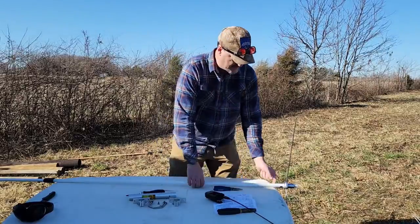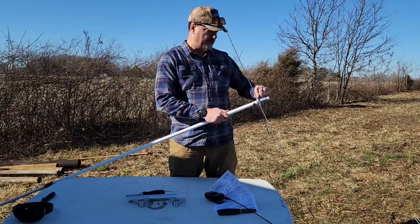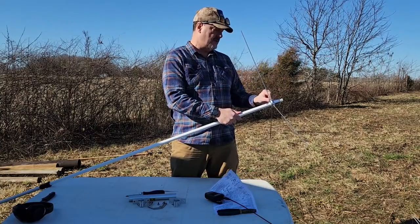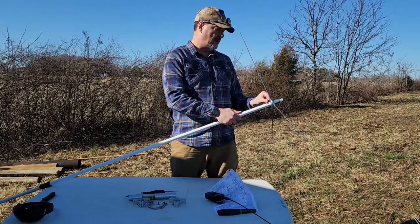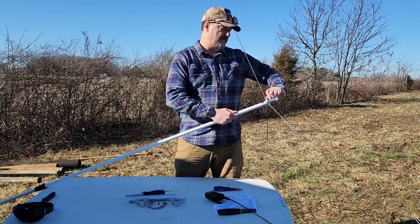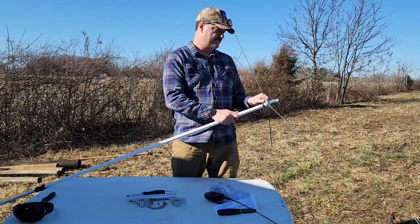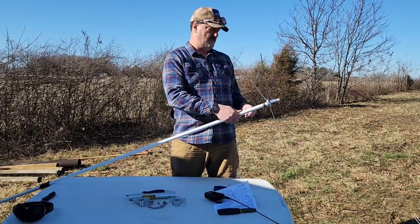Now we're going to come back with our wrench, or spanner as it's being called, and we're just going to tighten these down a little bit so there's no opportunity for these radials to come loose or to work themselves loose. These are going to be up in high wind conditions, this antenna, and through vibrations and so forth, might try to back out. It's not likely, but with these nuts tightened down just a bit, you don't have to overtighten, that will prevent that from occurring. And we'll double check.